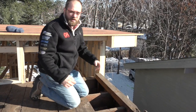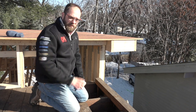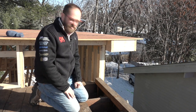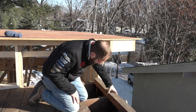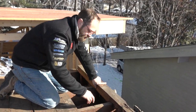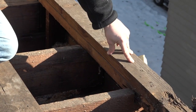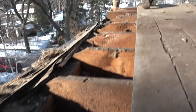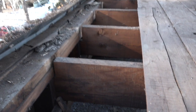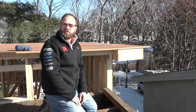This old balloon frame house — we knew basically how they built it, but we weren't 100% sure until we opened it up. We had a bunch of theories on how they built this roof structure, and none of them were right. What we found was that here we've got our top plate, but our roof starts below it right here and slowly moves up over the top plate until it's a full six inches above the top plate on the opposite end. The entire roof structure is hanging off a ledger attached to the wall. For 102 years it's worked really well.